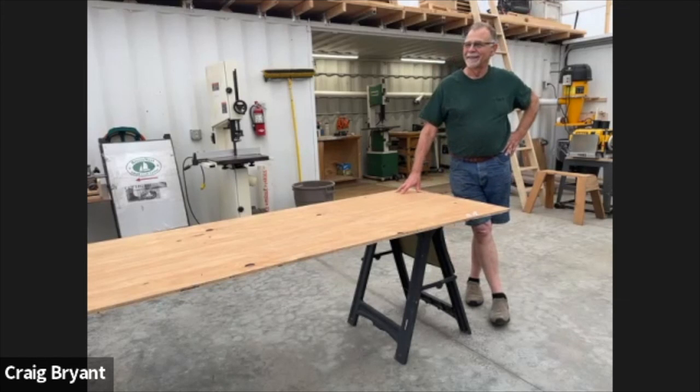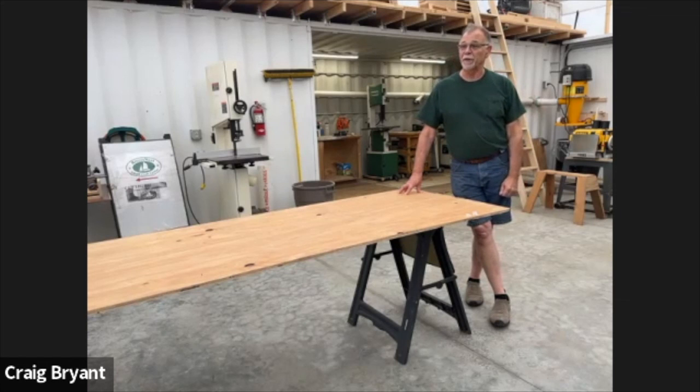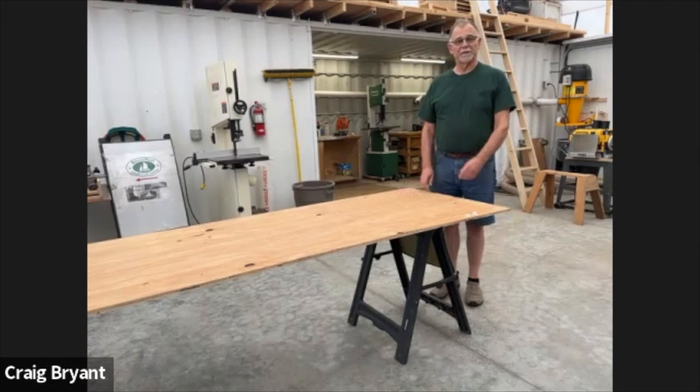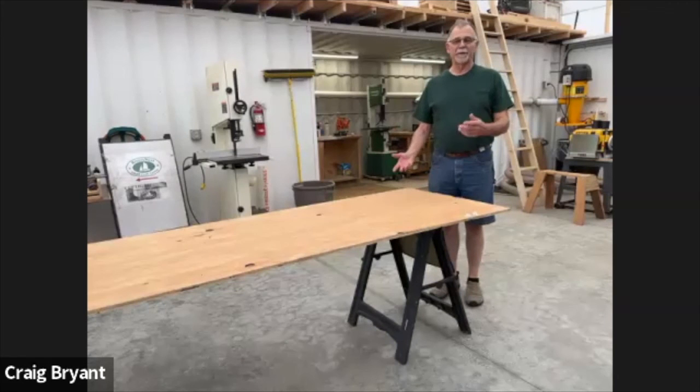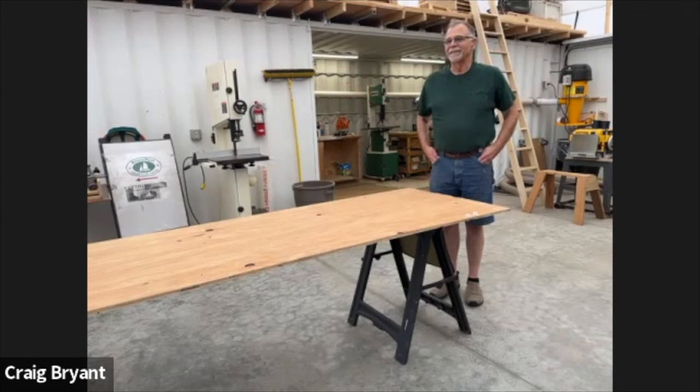You can still improve your situation somewhat by scoping out the board, seeing where it's low, and then just doing the ends. When I was making the mast I'm working on, the first thing I did was snap a chalk line and cut one edge with a little circular saw, to get it as straight as I could make it. Just clamp a straight edge onto it and cut that as straight as I could, and then work from there. But still, they wind up warped. And there you just choose the pieces you glue together so that they fight each other rather than help each other.